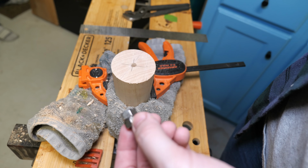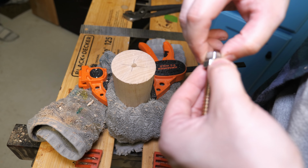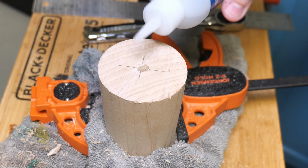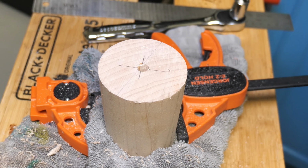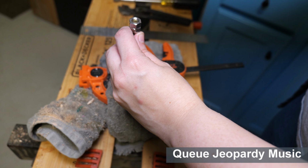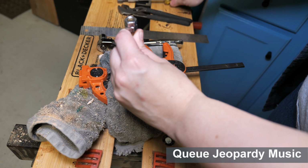The hanger bolts were screwed in by first attaching 2 nuts to the end that were then tightened together. Then I used a ratchet to get better torque for screwing them into the leg. I put in some CA glue before I screwed the bolt in as well to make sure it was secure, but there is a time limit to this, so you have to be relatively quick about it, which makes using the ratchet better.